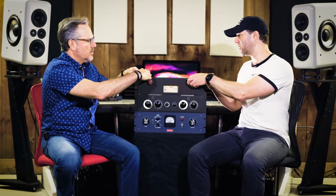And we haven't talked about the gain reduction tubes used in each and how they're different a little bit. But there are controls for balancing the two tubes that create the gain reduction on this. So a good way to look at this is this one has one tube. We'll just call it the compression tube for now and keep it simple. This has two tubes, two pentodes for that compression effect. And this is a later compressor, so they sort of evolved. Five, six years, something like that? Yeah, five or six years. They evolved into using one tube here that has two sides perfectly balanced instead of having to manually balance those two tubes. So I think this is a really important thing.